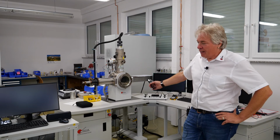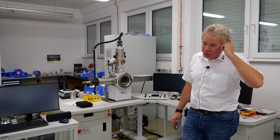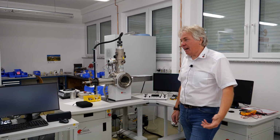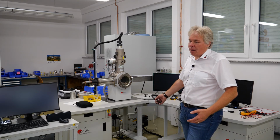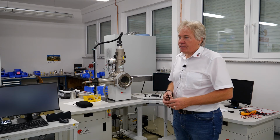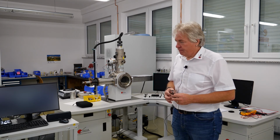This is only air-cooled. There is a version which needs only power, no compressed air, no water cooling. This goes up to the limit of a single phase, 3.5 kW, 16 amps. This is mainly related to the high voltage supply. If that runs at full power and the pump runs and everything runs, we're approaching the limit of the single phase. The other 2 machines work with 3-phase 400 volts.